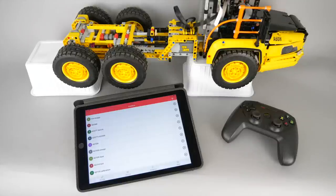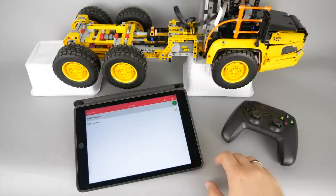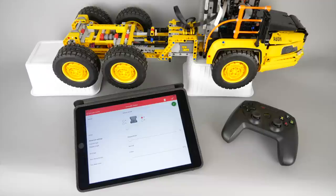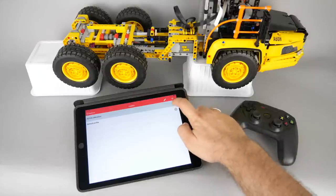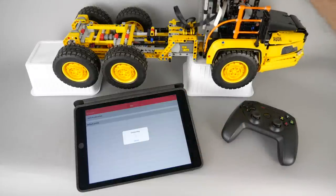We need to calibrate first the L motor that controls the gearbox — I created a separate profile for that. It has a single controller setup and it rotates the motor by 5 degrees each time. This can be used to rotate the gear indicator to the position of the first gear, as close to the 90 or 0 degrees position as possible.